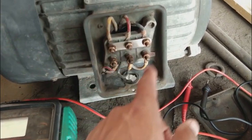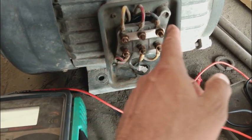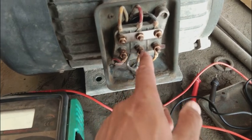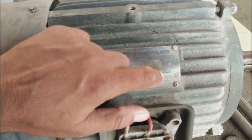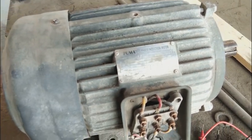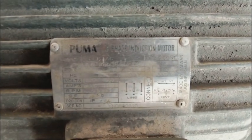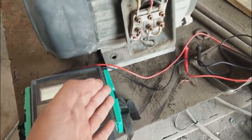This is a star-connected motor. As you can see, on one side these plates are connected and here the connections will be made. The nameplate of the motor is showing that this motor can be run either in star or delta, but the voltage difference is there. In star you can run it on high voltage, and in delta you can run it on low voltages.